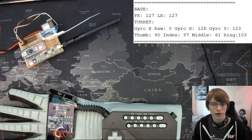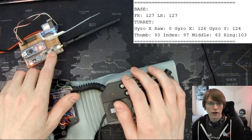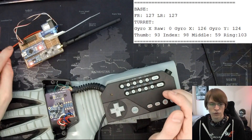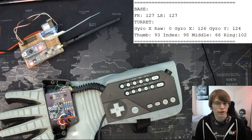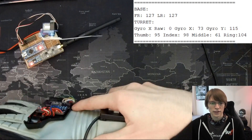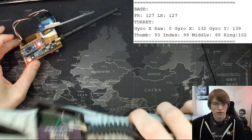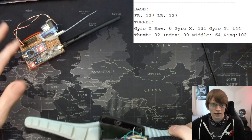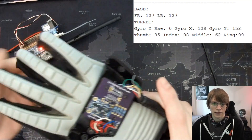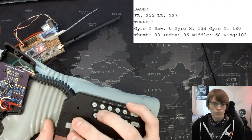In the top right, I have a serial monitor showing all the data coming from the power glove — connected over USB right now. Here I have the receiver module built for the robot. It has an NRF module on board that receives the signal from this one, and an Arduino Nano that processes the data, makes sure everything's within bounds, and sends it out to PWM pins that control servos, motor controllers, or anything you want. Just for this demonstration, I have a couple of servos set up — a pan and a tilt. You can see that when I roll the glove right and left, the servo follows. If I tilt up — you can see it follows, or it's inverted because I need to invert the servo, but you get the idea. I'm also sending the flex sensor data, and if I flex these fingers, and even some button presses — forward, reverse, left, right. You get the idea.